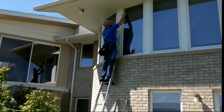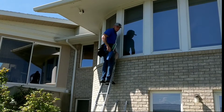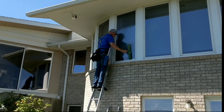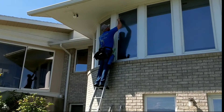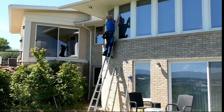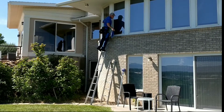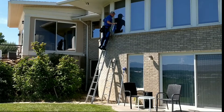Once you've reached the point where you're going to do your work, make sure you're still balanced. I'll give it a little move with my feet — I don't usually bounce, just a little move. No movement there; I know I'm going to be safe. Notice that in all my placements, even when my foot's off the ladder, I still have three points of contact: my foot, my knee, and my other knee are all touching the ladder. I always maintain three points of contact.